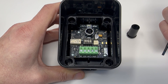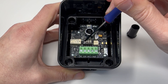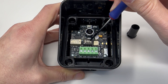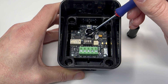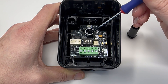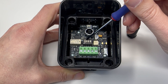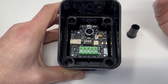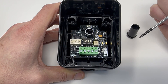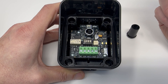For two-wire pulse monitoring in the two-frequency mode — covering both zero and 300 hertz frequencies — DIP switch one is in the on position, and switches two, three, and four are all off. You would just have a wire hooked up to each of the two power leads, and we would communicate with the operator board over those power leads by changing the frequency on that line to determine whether there's an obstruction in front of the eye or not.